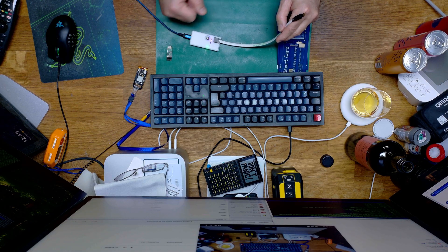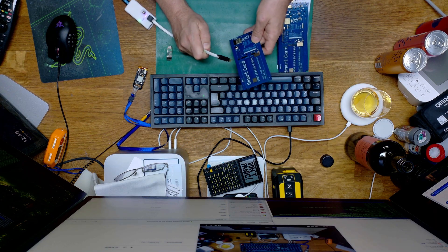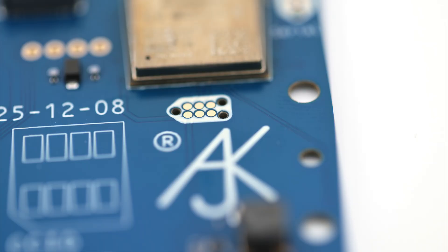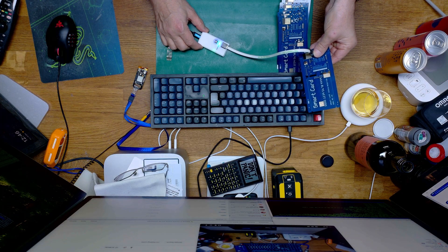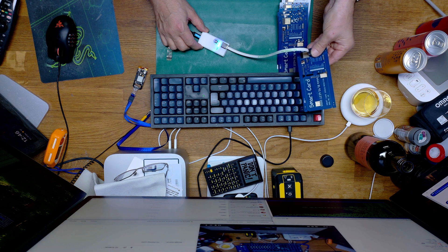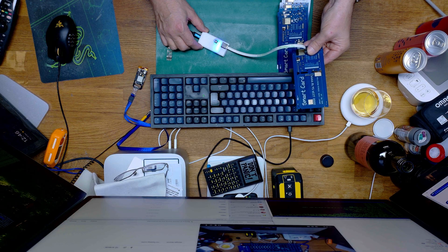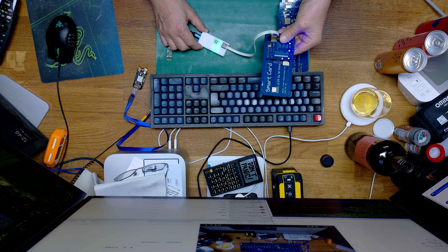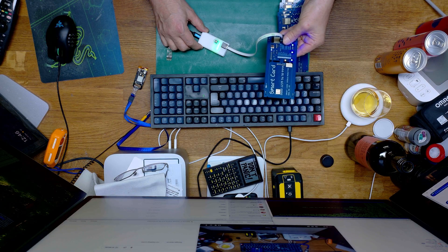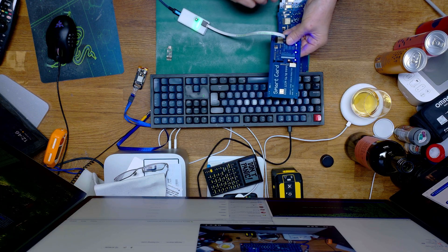So how does it work? Well, it has this connector on the end — it's a TC2030 connector, and you don't need a socket on the board, you just need pads like this. I plug in the connector and on its display you will see it shows progress of flashing on the blue light, then it goes green, and the green means the board claims to have passed its internal self-test. There's actually a loopback in this cable deliberately so that boards can test something using the loopback on the cable.